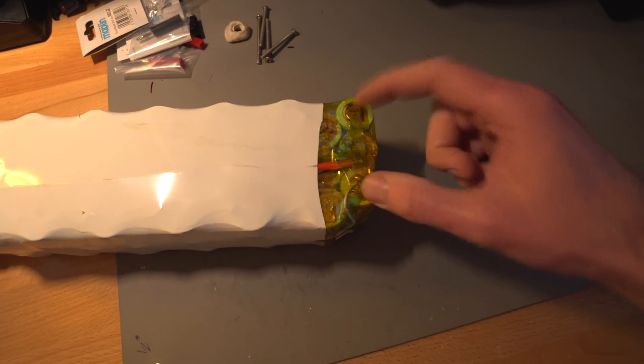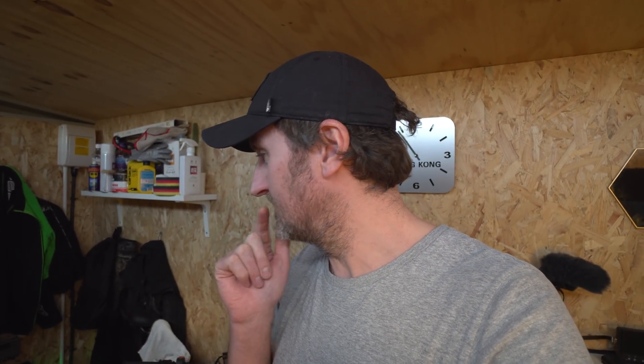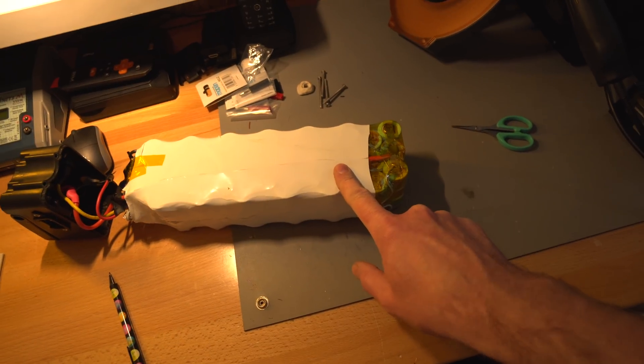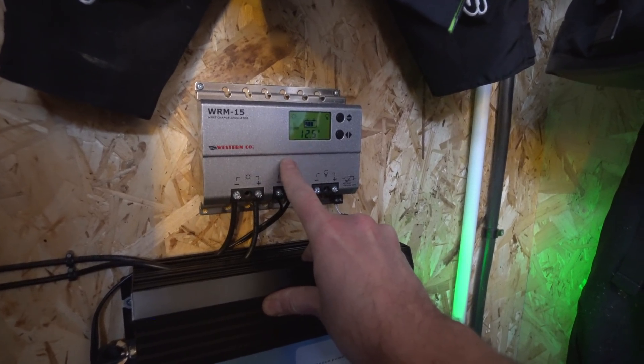The plan is to break these cells off as individuals, then parallel three banks and do another four. But one thing I'm thinking about is whether this inverter will run on 15 volts — actually it'll be more like 16.8 volts when these batteries are fully charged. On paper the maximum voltage for that inverter is 15 volts, so I could partially charge this pack to maybe four volts a cell. It's something I've got to think about — I need to test the inverter on higher voltages before going down that route.